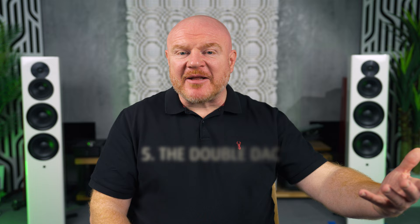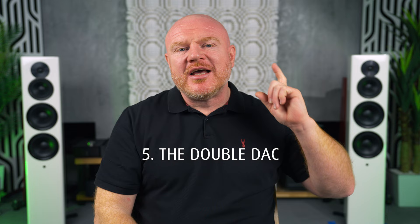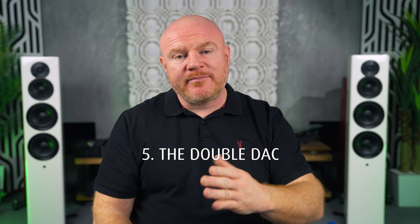Number five might be even more controversial than number four. I get to see and experience a lot of things through my calibration work. Some of my calibration customers choose to use an external music source and external DAC fed analog into their ARCAM AVR. That signal is then converted from analog back to digital to have all the Dirac Live correction applied, and then converted back to analog again, sent to the internal amplifiers, and played through the system. So there is an additional analog-to-digital stage in the process that technical people would say makes no sense.